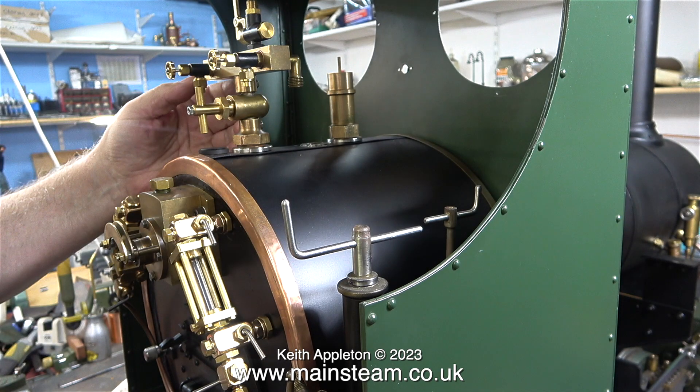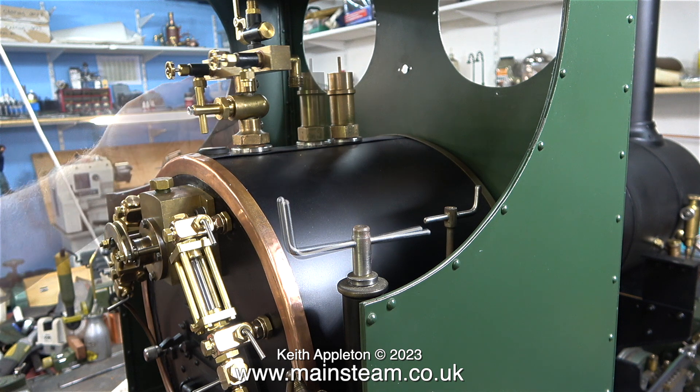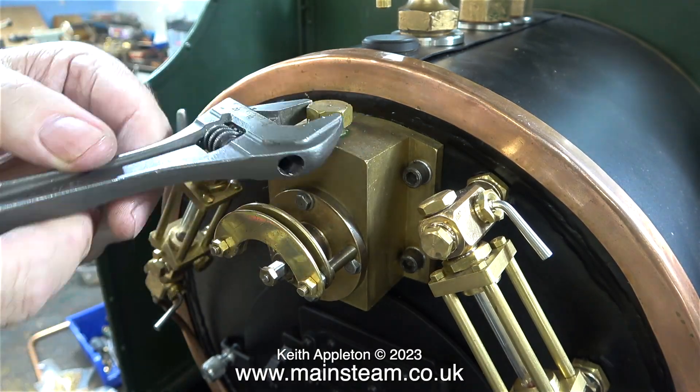At this stage I realised that I had forgotten about fitting the steam-operated cylinder drains. There are a couple of blanking plugs in the turret, and the one at the left-hand side at the back of the turret needs to be removed and replaced with a steam unit. Then I'll be able to supply steam to the tap, which in turn allows you to admit or exhaust steam to the steam-powered cylinder drain cocks underneath the cylinders.